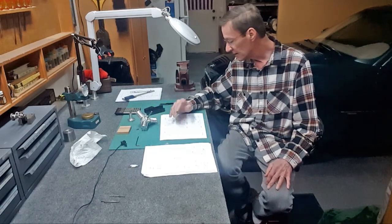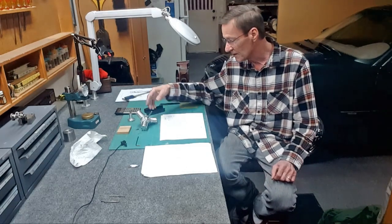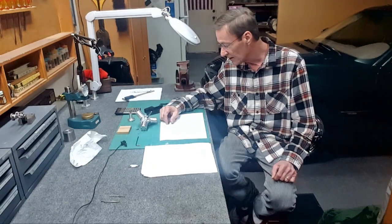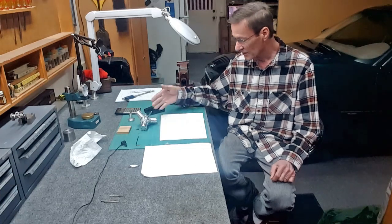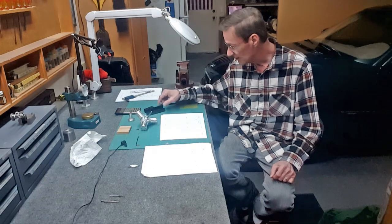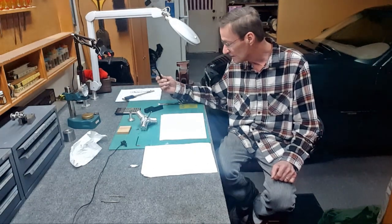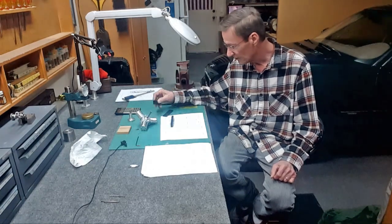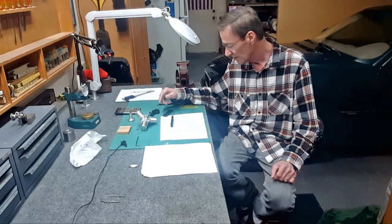So in this video you'll see some of the machining of a cylinder. I didn't record grooving it at all, so you're just going to see making the bore, the 1/2-inch bore, and drilling the holes and stuff. And you'll see the extensive use I had of plastic to keep from marking it up with the V-block that I made. I think I used the 60-degree thin one.